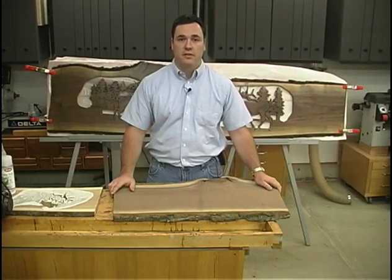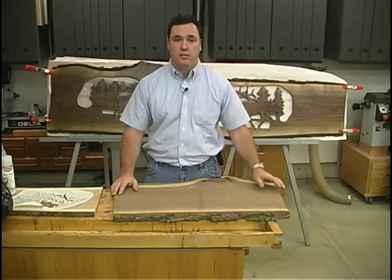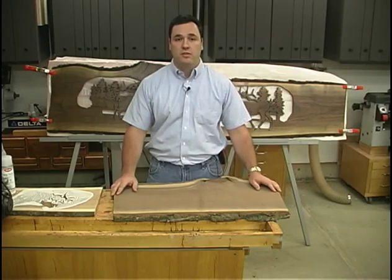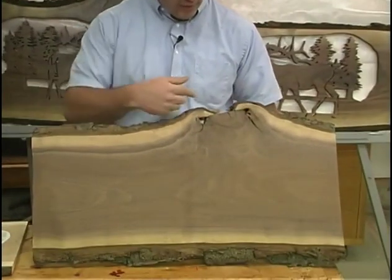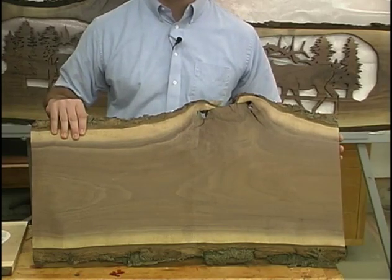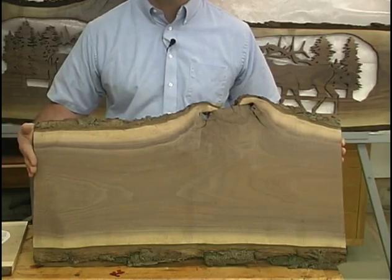Today we're going to go through and show you some of the techniques and ideas that I've worked with in the past years of cutting out some of these larger pieces, as well as even smaller items, maybe a foot or two feet in length. I've got a piece of black walnut here that I cut and machined. What happens is I go and cut all my own logs, machine them into slabs, sticker them, and then dry them. There's a local mill in the northern portion of Wisconsin — I buy an entire log. When I look for these logs, one characteristic I try to find is broken limbs that have been cut off years back before the tree was taken down. As you can see on this black walnut, there was a limb right here, and the tree will actually start to grow over the top and create like a scab. This is a piece I've cut into a smaller section, ready to put a pattern on and start cutting on the scroll saw.